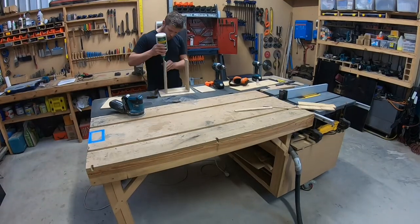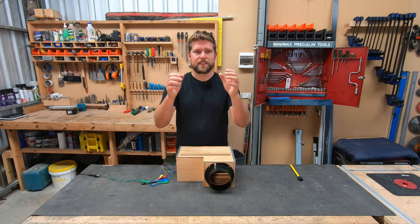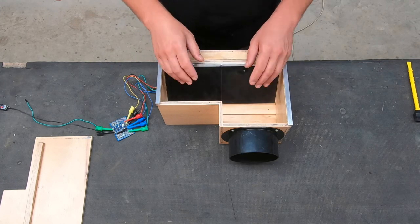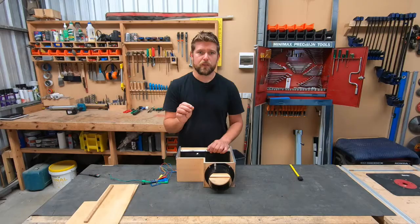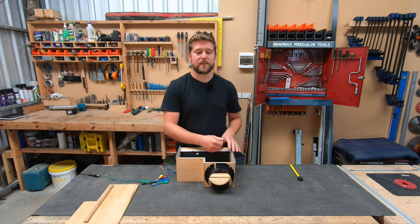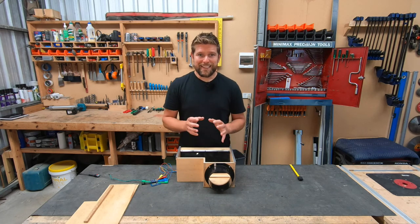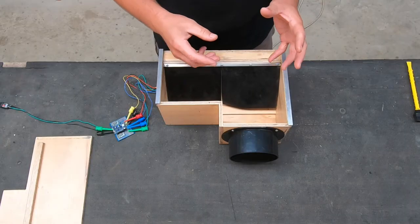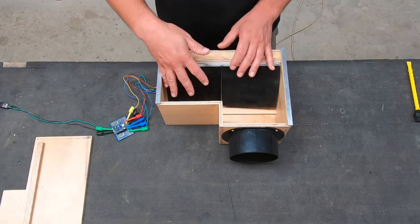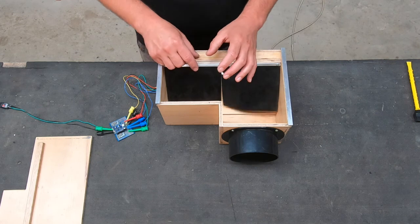My ventilation box allows me to attach fans onto that narrow skinny duct that goes through the tiny house. It draws in through the back and then vents out through a 125mm duct that exhausts out through the cowl on top of my services hatch. On the inside I've got two super quiet, really efficient computer fans which makes them easy to replace down the track. On the front I've got these two silicon sheets which perform two functions. First, it stops back drafts - one thing I learned from the micro tiny house is that in really strong winds it can actually get wind pushing back through the system and up through the composting toilet, which is not ideal. So the silicon sheet stops the wind from pushing backwards through the system. Secondly, it allows me to control my fans independently - with the main fan running we can see it drawing air in through the back, lifting up the silicon sheet and exhausting out the other side, while my secondary fan is idle with the silicon sheet down, sealing over the face of that fan and stopping air from being drawn backwards through it, which allows me to maintain a negative pressure in my duct.